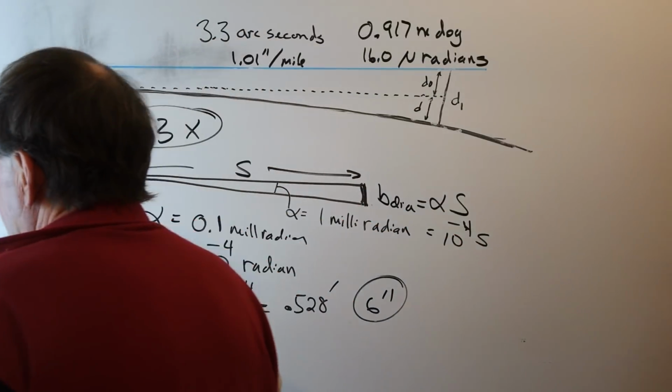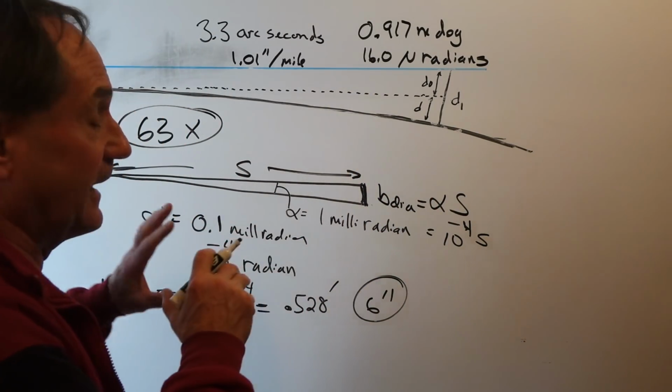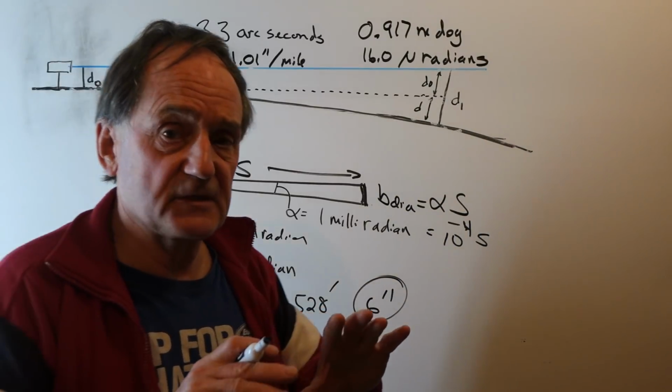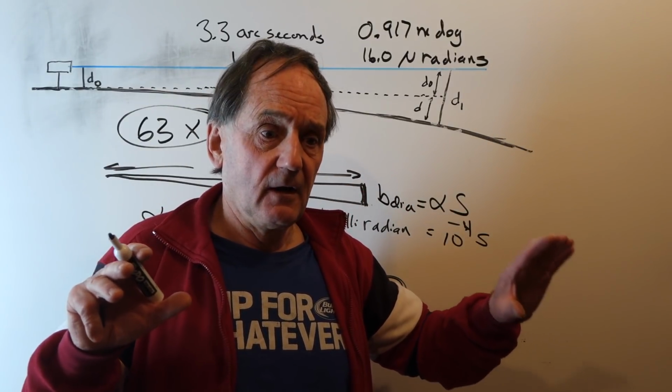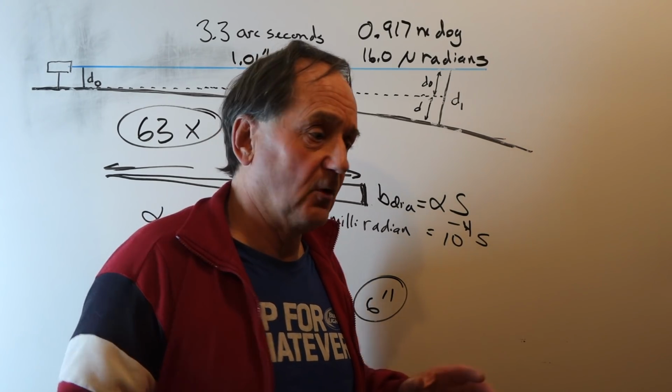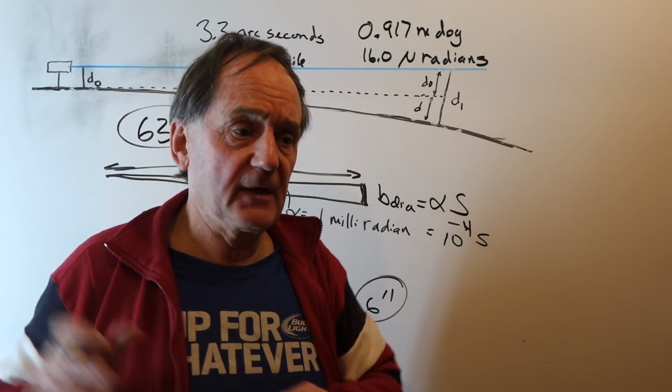Now I'll talk about how we can fix this all up with the method that I have conceived to replace this fence of rails that Brian Mullin had envisioned. I'll show you a much cheaper way to do it and a much more accurate way of setting it up than trying to line up all these rails butted up against one another. Now, what I'm proposing is that to align the structure, to establish a straight line tangent, we use a surveying auto level.